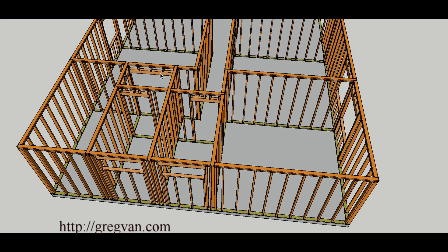Let's say you remove this part of the wall thinking it's a non-load-bearing wall, no big deal. Now you've separated the connection and reduced it to about a six-foot wall. Without putting a strap on, you could remove this section and keep the tie as long as you have straps or some type of connection carrying it all the way through. I'm not going to go into detail on that — it would be a little more advanced framing.